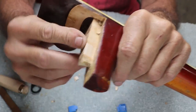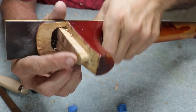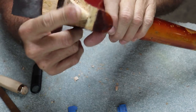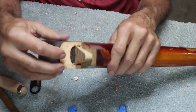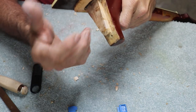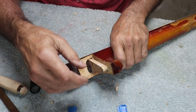You can see the little plug I'm putting in there — obviously it's bigger than it needs to be, but I can glue that in, clamp it, and then shave it back down to the original. You can see there that we've got the little fill piece fitted in there. It's perfectly smooth now, so when we shim everything it'll all be even and nice and solid. That won't come out of there for sure, especially glued with Titebond and clamped.